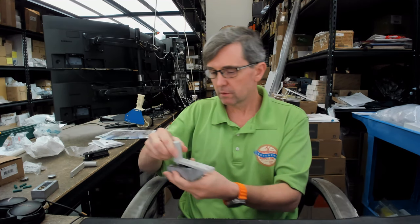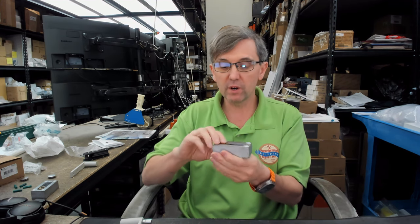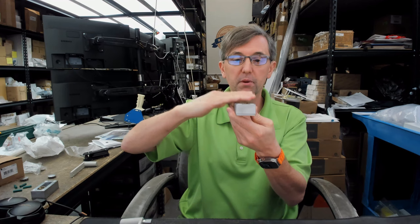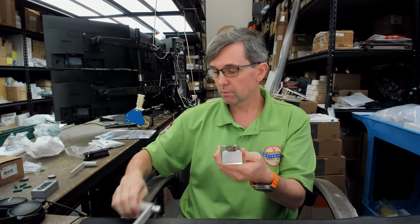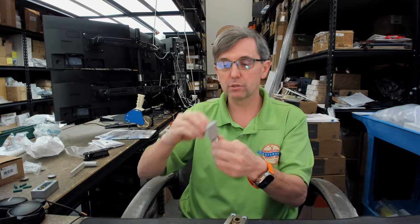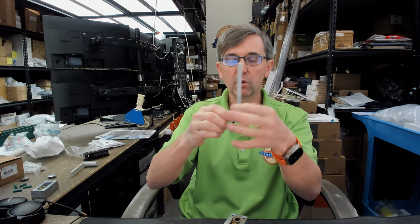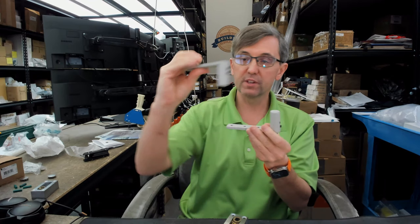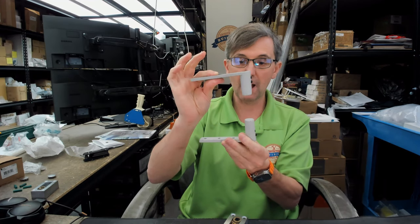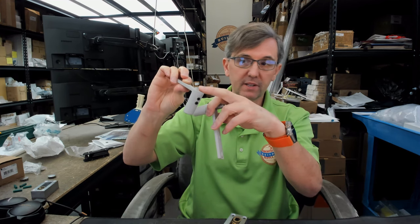Anyway, the installation of the 551 is that this is all going to be mortised. It'll be flush to the floor. It'll be mortised up into the header. Okay, you're going to attach your bottom arm. It'll be assembled like this. You'll have the door mortised. This will be attached to the bottom of the door. This will be mortised and attached to the top of the door. That's held in with the set screws, so the pin is kept flush.